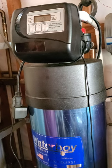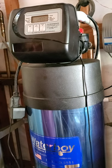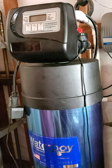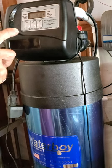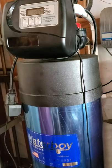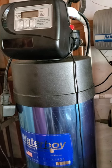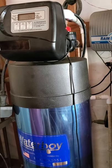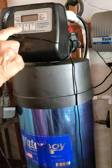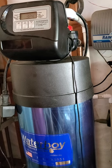And I'll show you in a moment how we set it up for every 14 days, could be every 7 days, but to make it on the same day every 2 weeks, we're going to set it up after I lock it in. The 2 o'clock needs to be locked in, 2 AM. The minutes also need to be locked in. The 14 is how many days before the next flush, and that needs to be locked in as well. Set button again, let go, showing the time of day.